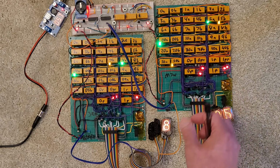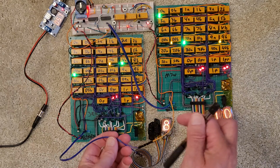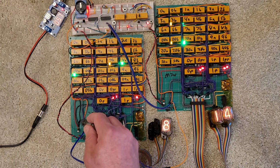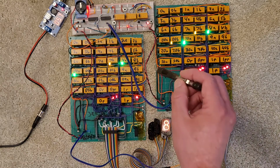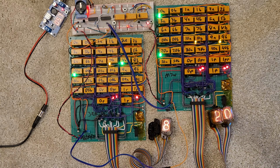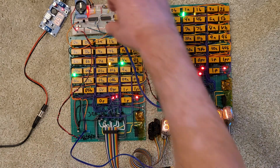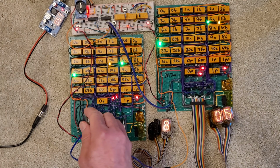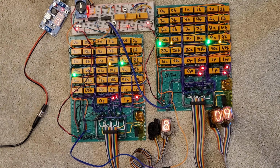And so then I have the carry out on this orange wire coming into the purple, and that comes in as the pulse per minute for the minutes counter. The gray, again, is the reset, and so if it's on 19 right now, I can just hit that with 5 volts, and it resets the counter back to 00. And then the carry out here would be used to clock the next hour stage.